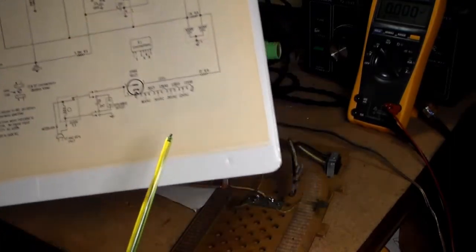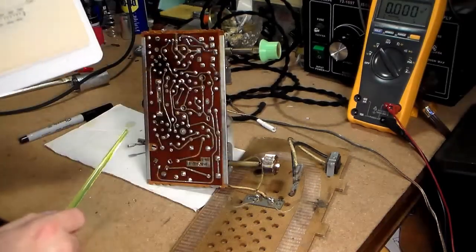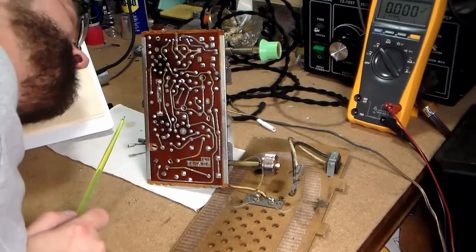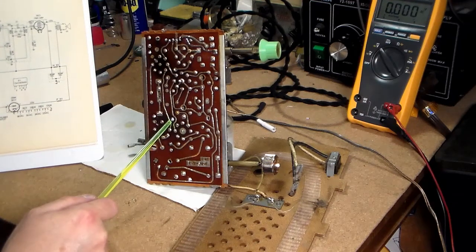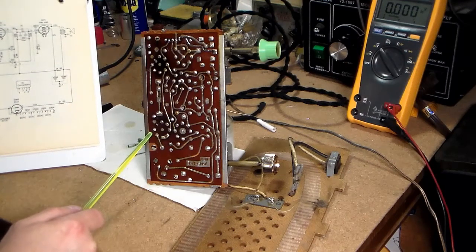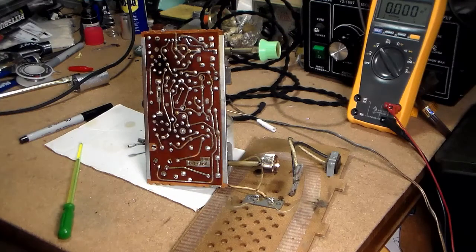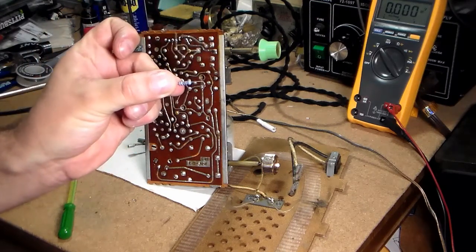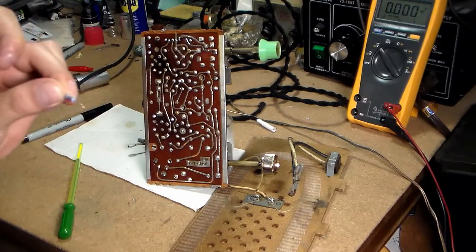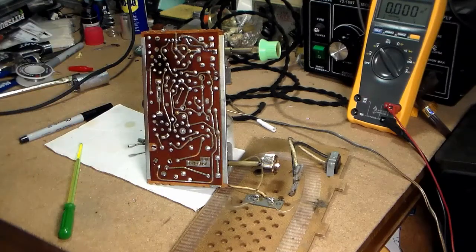So, you know, and I'm thinking, what the hell? So interestingly, it says 115 here. The way this is hooked up is pin 7 here, somewhere along the line. Well, anyway, so the 27 ohm resistor is from here to here. So I went ahead and I pulled the resistor out and I tested it. Well, it's supposed to be 27 ohms. And I guess I can't read, or I couldn't that night. So this is a 5-band because it's 2%. But anyway, I misread it, and this is 27K. Well, that's why I had 60 volts.